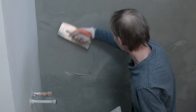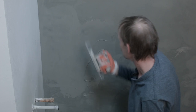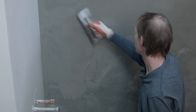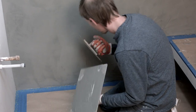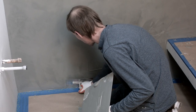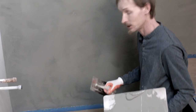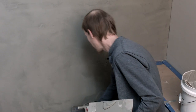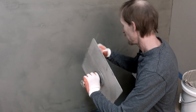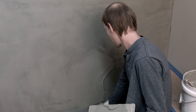Even though the product brand itself says that it's waterproof, it will still take on a little bit of water. I don't know if that would be good in the long term, so I actually put a penetrating tile sealer on it when I'm all done just to be sure it's going to be waterproofed. Down here at the bottom we've chosen not to put any tile base in the shower — we're plastering right down to the edge and then I'm going to put a little bead of caulk to separate the tile and the plaster. So I have to make sure and finish it perfectly all the way to the bottom.